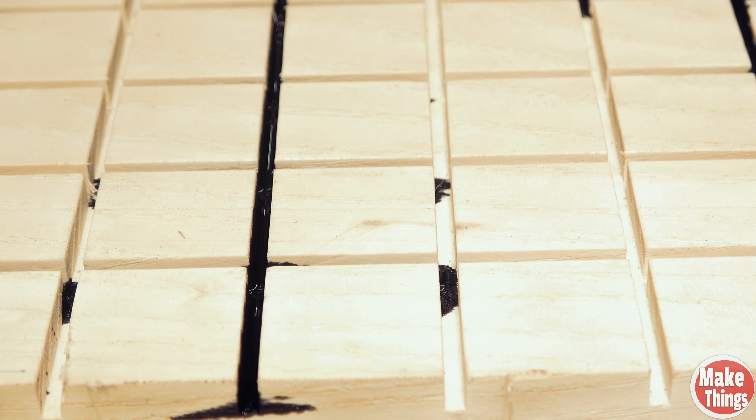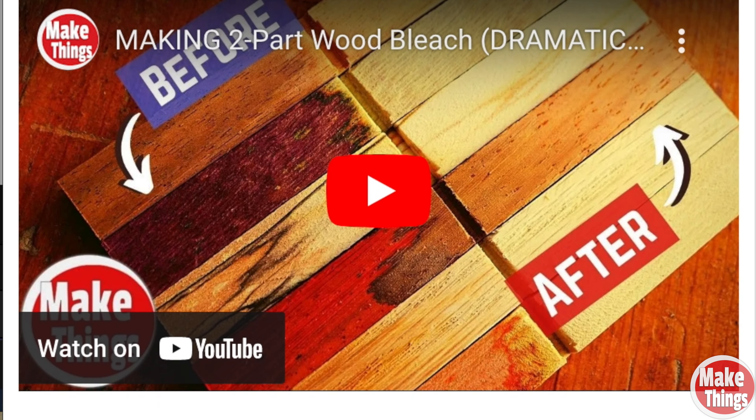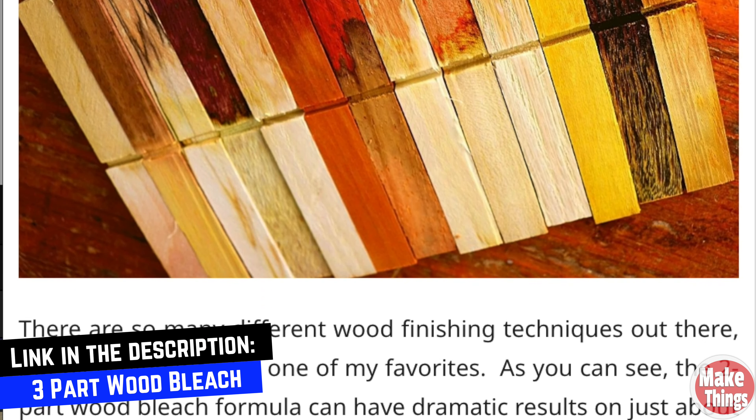You'll spray on your sodium hydroxide and allow it to sit for about 10 minutes before adding the second part. You'll notice a lot of foaming, which is good because you know it's working. I use a vinegar mixture to neutralize the surface, then add my dyes once the wood is dry. The store brand can take several coats due to how fresh the chemicals are, which is why I make my own at home. If you're interested in clear step-by-step instructions — including the neutralizer part 3 recipe not included in the store version — I have a link in the description.